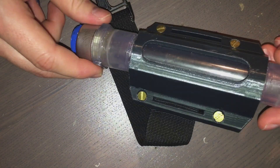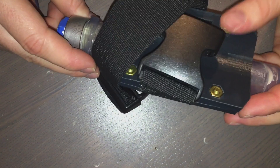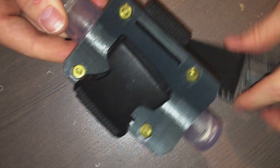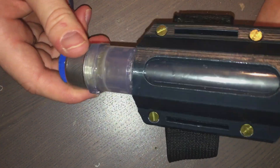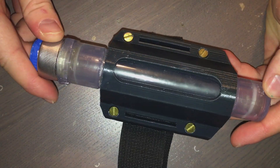So these are my old arm cartridges. They look alright. They've served me pretty well — I've used them for over a year now. They're made of clear PVC pipe with a plastic adapter to go down from half inch to one eighth inch NPT. They're bolted and clamped together with this 3D printed part here, and a standard buckle. Nice window to see the fluid level. However, these can only hold about 30 milliliters of fluid.